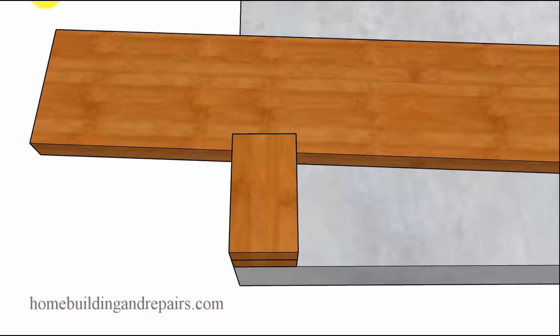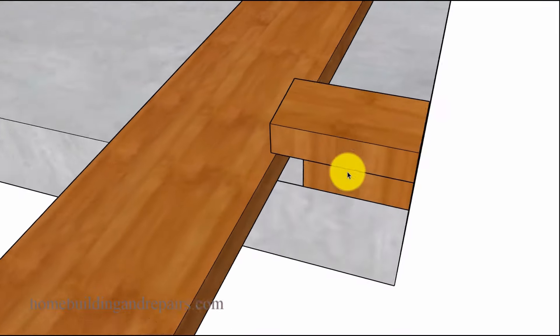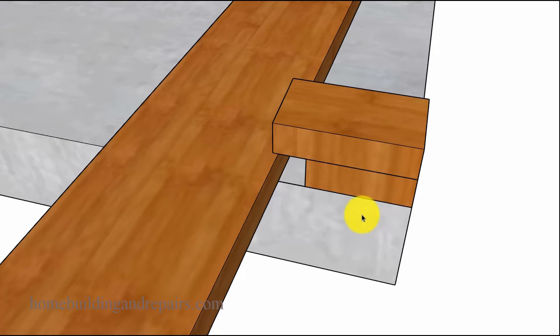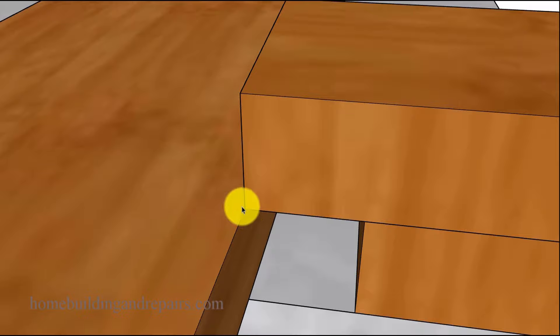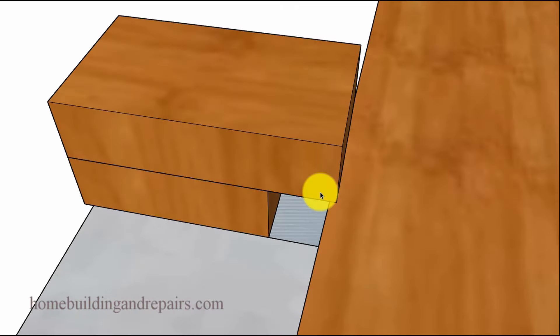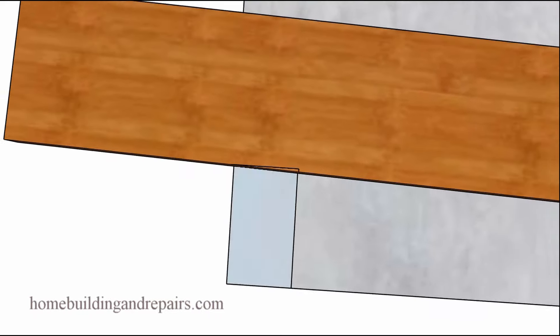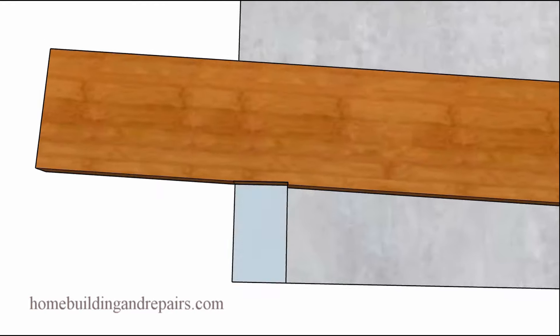Next, let's cut a couple of 2x4s. Make sure the corners are square — a 90 degree angle from this edge. These can be however long you want. Make sure this edge of the block lines up with the edge of the building foundation, and that this point of the block lines up with the corner of the roof rafter. We're going to use this to lay out and mark the seat cut, and you can see the notch right there.